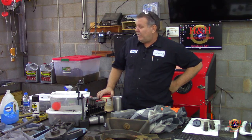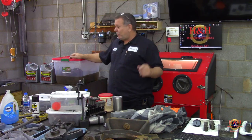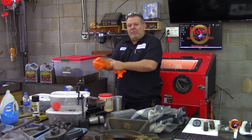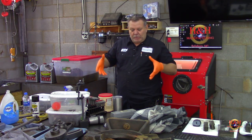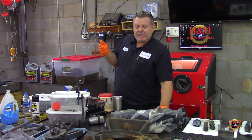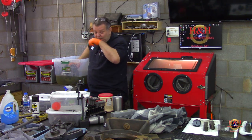Welcome back to the shop — this is the next day. I couldn't find any round tub that I really wanted, but I found a square tub. I did have to go buy some more Evaporust, and everything worked great. The parts are in it, but the scroll back plate didn't quite have enough fluid on it — it barely covered it — so I'm letting the bottom part soak a little more. You can tell that when the lathe was stored outside, the bottom half of the chuck held some water, so there was also some rust in among the grease and gunk.